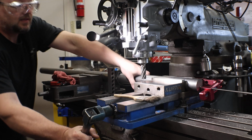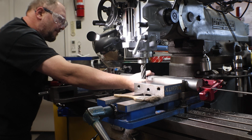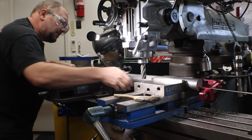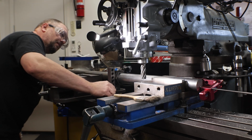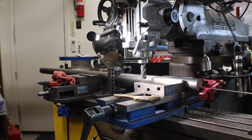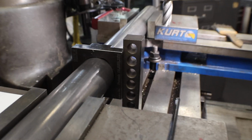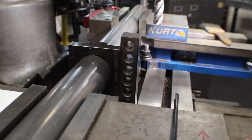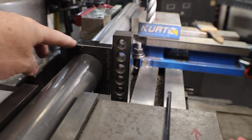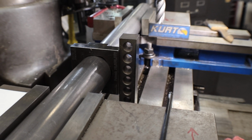And it's settling a little off. So like right now it looks good. Let's see how it goes again when I tighten it. Okay, that's good. Well, see if we can look in there. So right now there's no daylight. There's a worn edge. The light picks up on the edge, and so you'll see that, but there's no light between the square and the indexer.